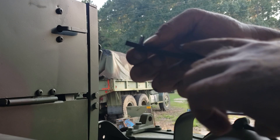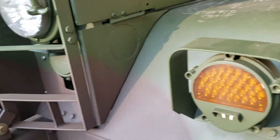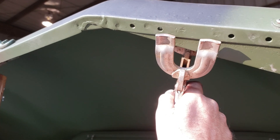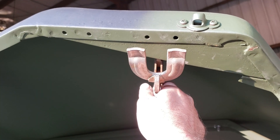It's installed tightly, flat, square, and true — and it looks great. Now, you'll only use one jaw on one rivet at a time since two will never line up simultaneously. The reason you can use vice grips on the two inner rivets is there's a short enough span there, but for the outer two you need something with a deep throat so you can get up around the edge of that reinforcement web and close it.